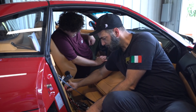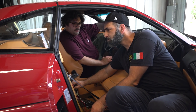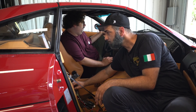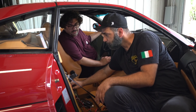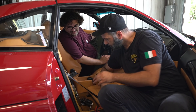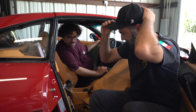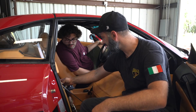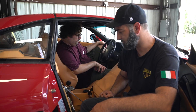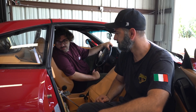The only wild cards remaining are the mass air flow sensor and the lambda sensors, which we can't check without the engine running properly. Mass airflow sensors are important — they cause a lot of runnability problems. But electrically the engine management looks to be in pretty decent condition. The grounds all pinned out okay, so we shouldn't have any major electrical problems to deal with during the major service.